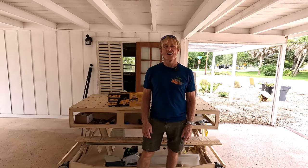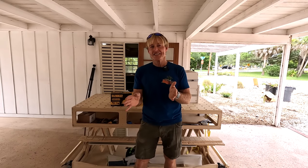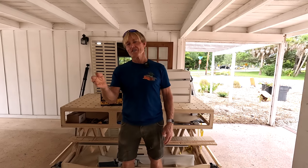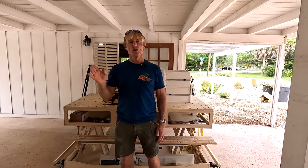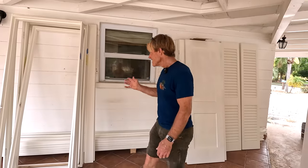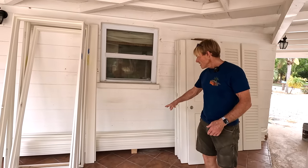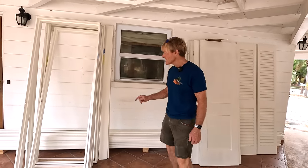I'm one tired dog. 2 days to get the trim package completely ready to go, cutting the doors down, cutting the jambs down, and painting all of the dimensional base and casing, the jambs, as well as the doors. Here it is, the whole trim package, all of the doors, all of the base molding, and all of the casing for the doors and the openings.